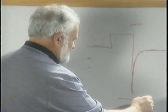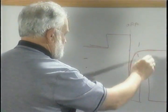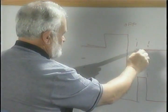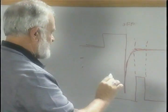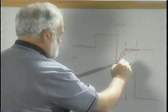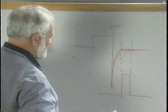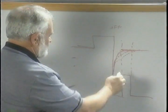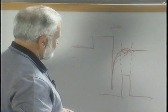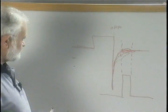We have a sample pulse that looks at the return signal during this period of time here. And what happens when metal comes into the field, this curve in the received current actually varies as the metal moves through the field and comes out again. We're looking at this area specifically for these changes, and that's what's converted into the audio signal that you hear.